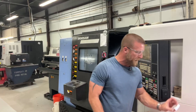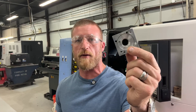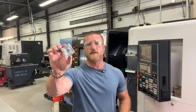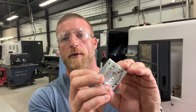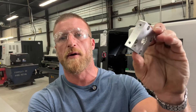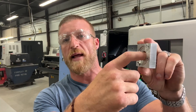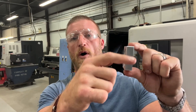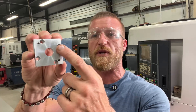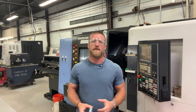Here's another one for example. This one — if you'd asked me a decade ago or more, I would say you're going to make this on a mill, and we'd make the whole thing in several different operations. But we're able to successfully make it in one operation. Pretty cool part for one op, right? All the sides are milled. We use side milling in Z, a whole bunch of Z-axis live tools, normal lathe work for the inside, turn the corners so the OD — which is just the rounded corners — is concentric to all the bores. We transfer over and chamfer all those on the sub.